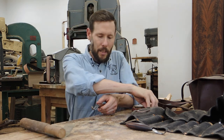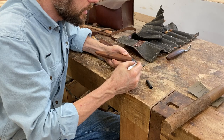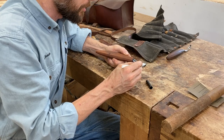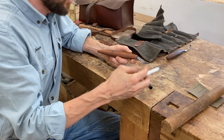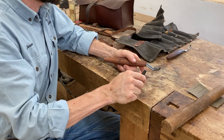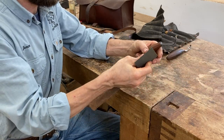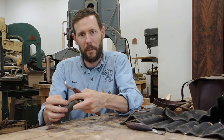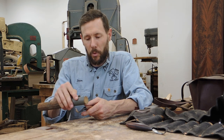A little technique that helps is to use a magic marker and darken these two guide rails on either side. What that does is show you exactly where you are sharpening and where you are not, and show if you're holding it true. There are two secrets to sharpening: the first is consistent angle. We can debate over what that angle is for any given tool, but the point is you've got to maintain a consistent angle to do a good job of sharpening, and that's what these guide rails do.